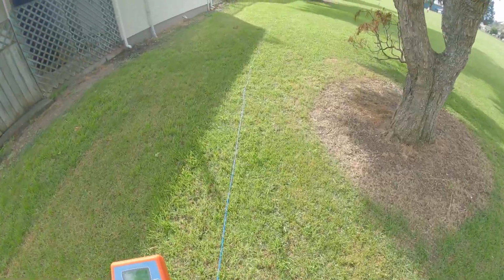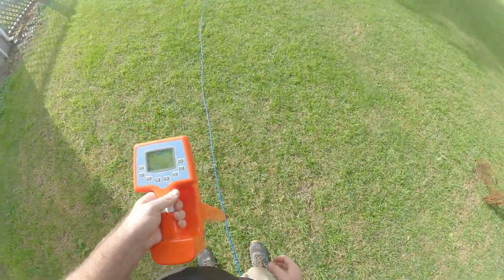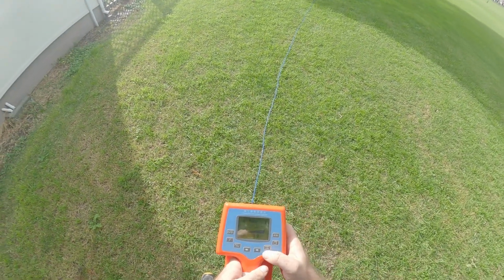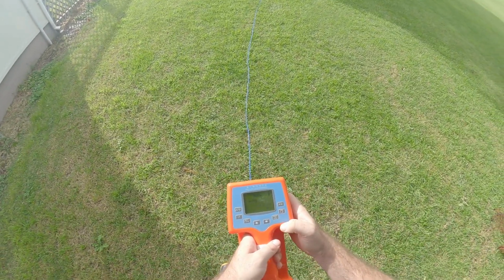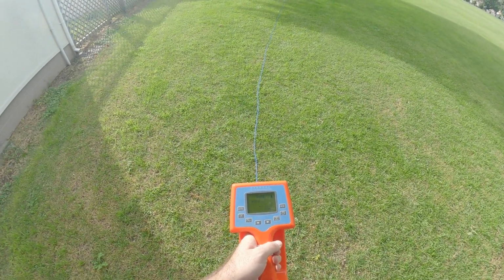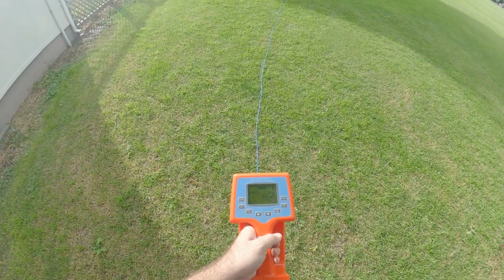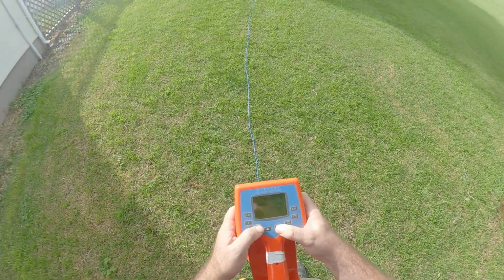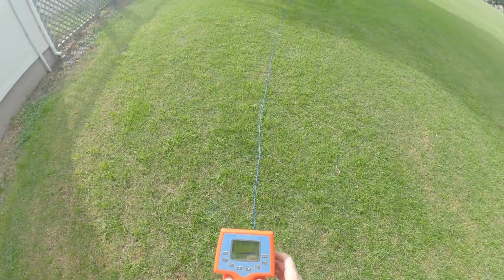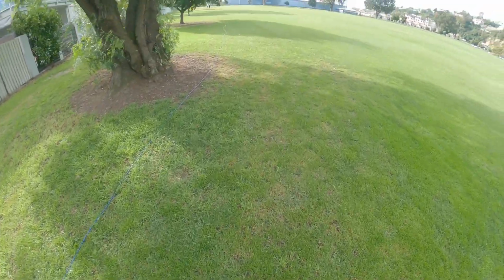Actually, I normally do everything in peak mode, so I'm going to try null mode here. See what that... no, it doesn't do depth in null mode. In peak mode, at 1% sensitivity, it's peaking. And we get no depth, no milliamps, 5,000 for a signal level. Okay. And we got peak for some distance away.